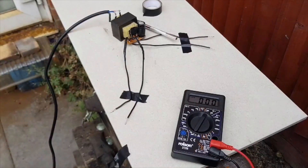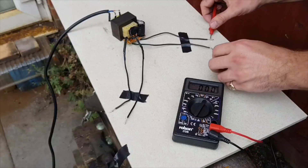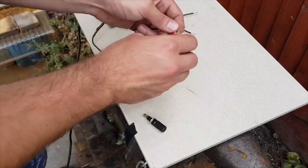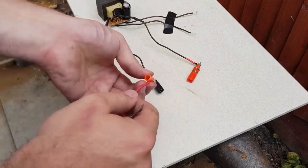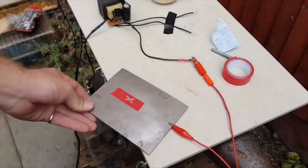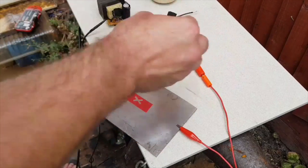Next I'm going to use this multimeter to establish both the AC and DC, and the positive and negative wires. If you're not sure how to use a multimeter, I'll include a link in the description for a good YouTube guide. The two wires soldered earlier to the transformer deliver AC, and the two already leaving the transformer deliver DC. The little plugs on screen now are banana sockets — they connect to banana plugs, which I've got in my hand. I'm connecting the banana plugs to some crocodile clips and testing the positive and negative to make sure I've got them the right way around.